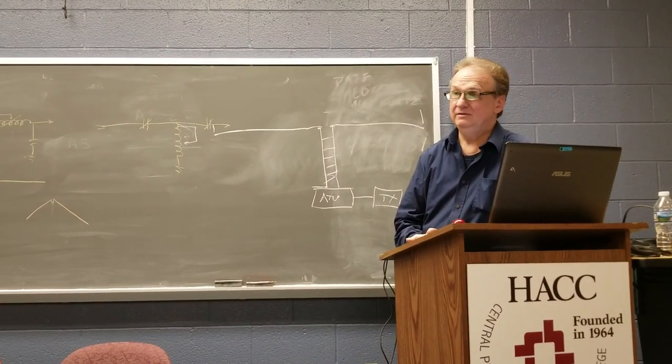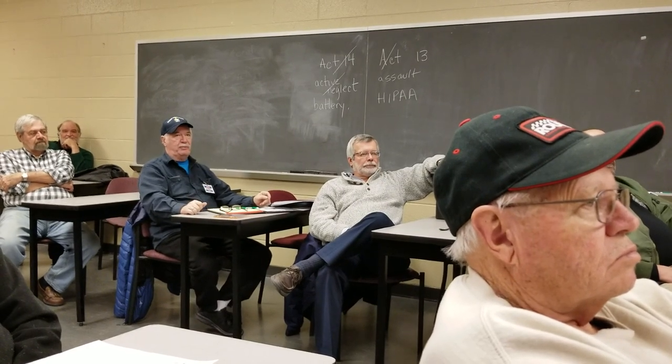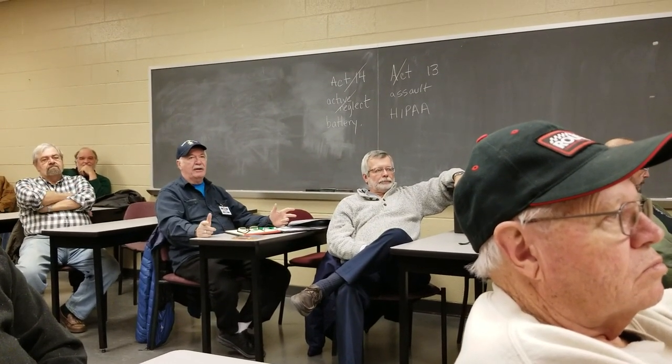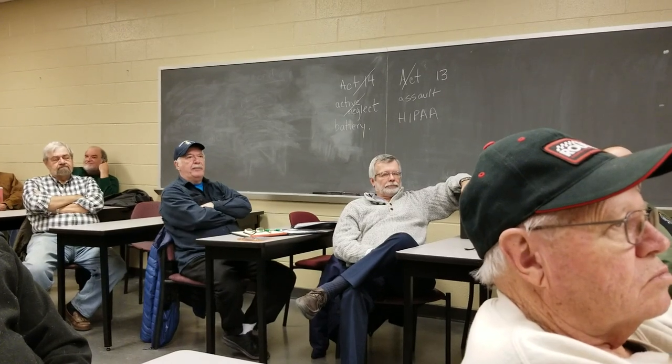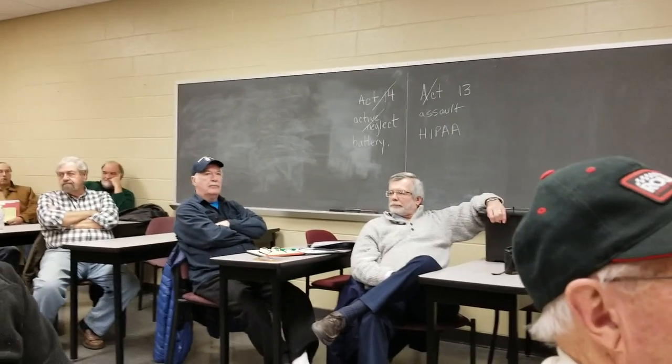Terry, one other comment. You showed the ladder line there with the ATU. To use that ladder line with that T, you need to transform the balanced transmission line to an unbalanced transmission line, which you'd have to do with a transformer or a bunch of capacitors and coils, which are a pain in the butt. So the balun is the easy way to do it. Yeah, on most ATUs, when you look inside, the balanced cables go right into a balun.